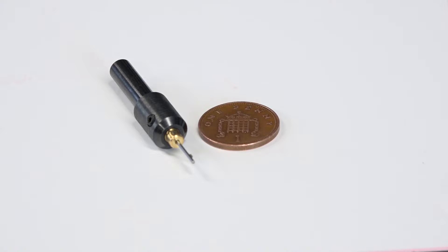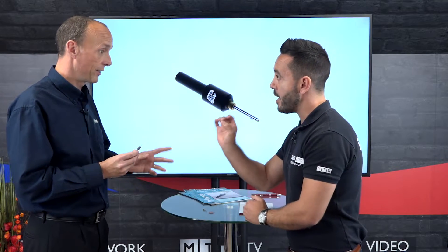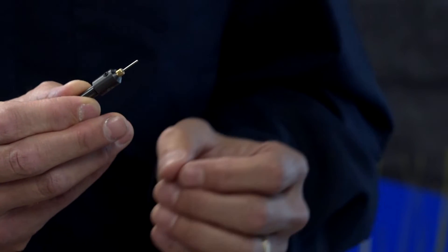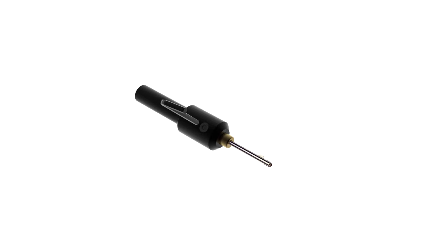The increments from 1 millimetre to 2 millimetres are 0.1 of a millimetre. Now, in regards to it — it's not just chamfering the front side of the hole, it's actually chamfering the back of the hole as well. It's the same principle as our standard burr away tool — both sides of a bore in one pass. It's a spring-loaded blade, very simple really.